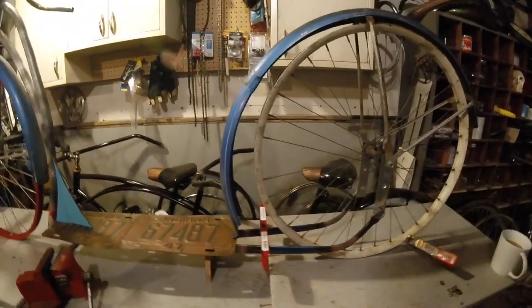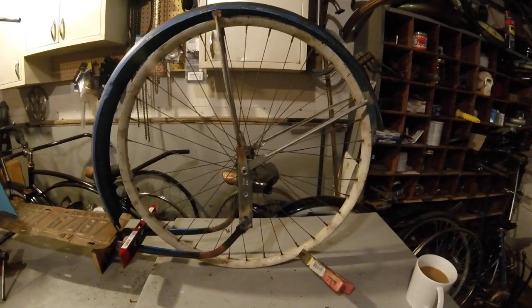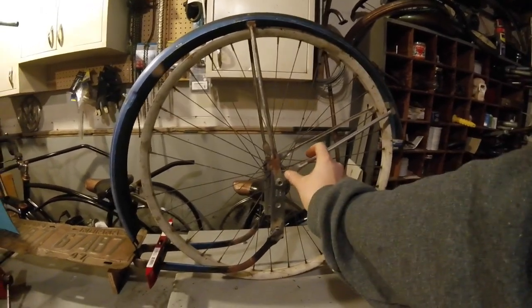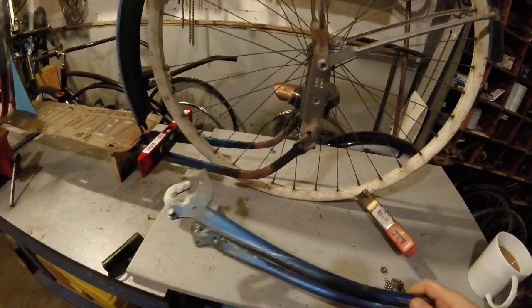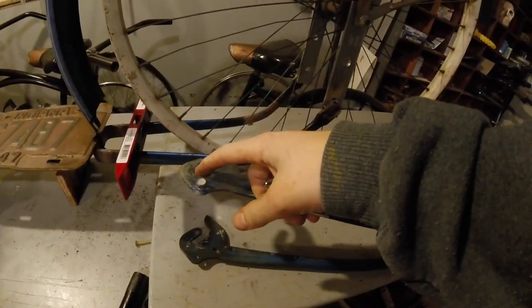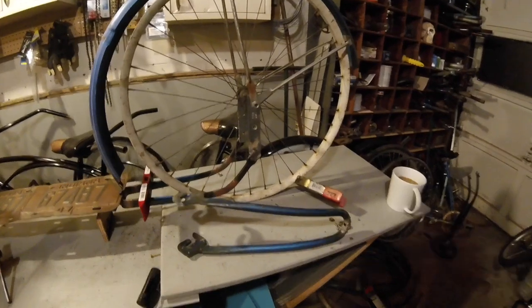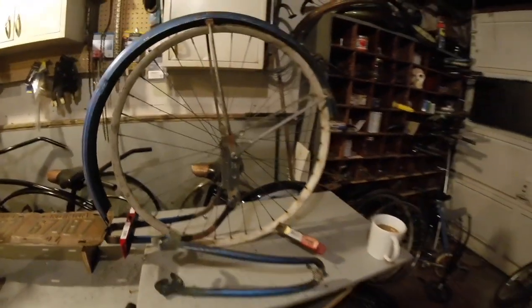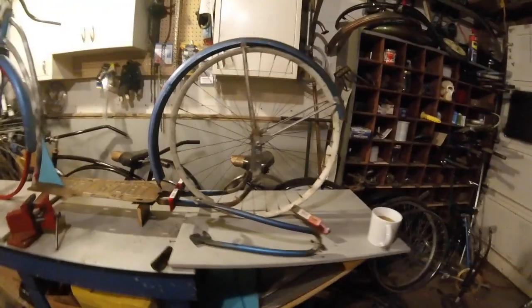This gap with the fender here and the gap back here is not the same, but I just have it sitting on there. Originally, this bike had a wider rear portion where these fenders went, and they actually mounted on the exterior part of that drop. So when the bike axle was here, the fenders mounted up on this screw. I think I'm going to have to either tack weld something on the end of those, bolt something on, or drill a hole in this steel plate and raise them up. Otherwise, I'll drill the rivets out and use a longer wire fender stanchion — so that's easily changed.